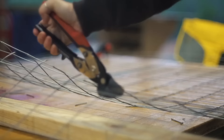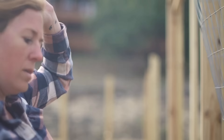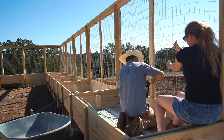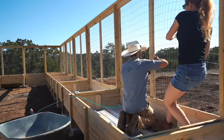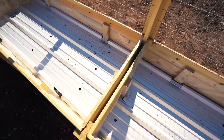After the top trim and cap are in place, now it's the fencing. You can go with a wide variety of material here depending on what look you like as well as what animals you're trying to keep out. Once the panels are cut to the proper width, they just fly going up. But this is most certainly a two-person job because the fencing needs to be pulled or stretched to lay down tight without waves in it. Jake would start off by stapling one side to the frame, then I would pull each section as much as I could so that he could staple it to the center member, and we would rotate around so I would push while he stapled the last stretch on the right.